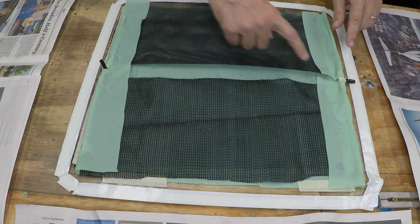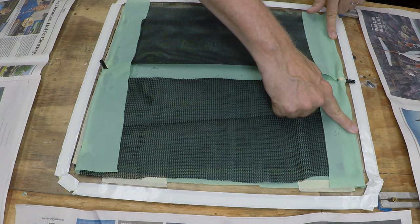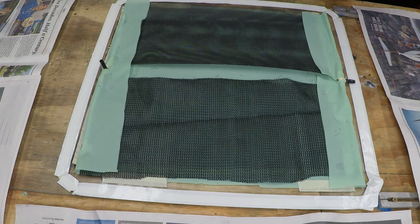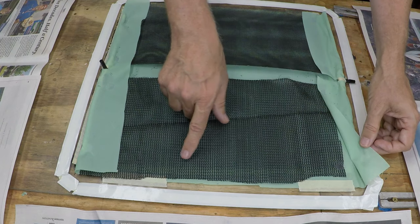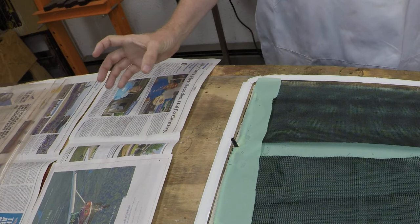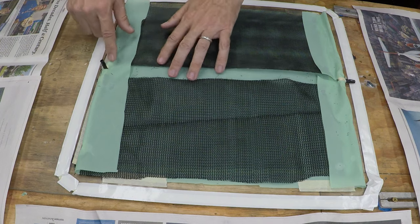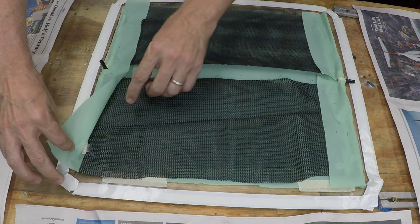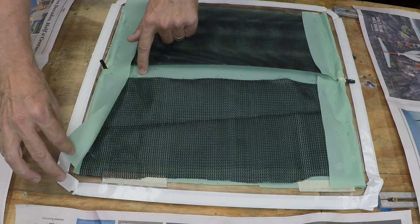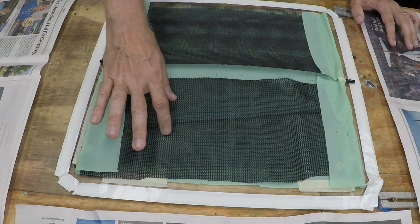On this part, I'm going to use a vacuum that is pulled over on this side, with a spiral tube running down along this edge to pull the vacuum and any excess epoxy. To reduce excess epoxy from running out, I've stopped my flow media before it reaches the spiral tubing. I'll have a cup of epoxy resin with a tube coming into this inlet. When pulled in by the vacuum, it will run down the spiral tubing on this side, then down into the flow media and part underneath, including the peel ply, and get sucked along to the vacuum side. The purpose of the flow media is to help the epoxy flow through and allow air to flow out.